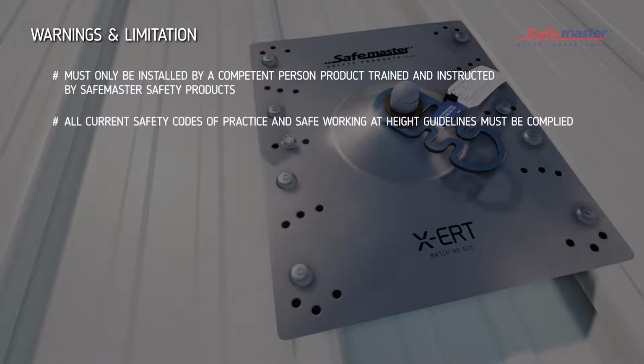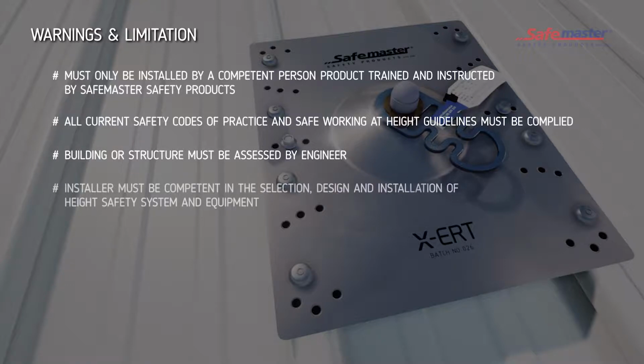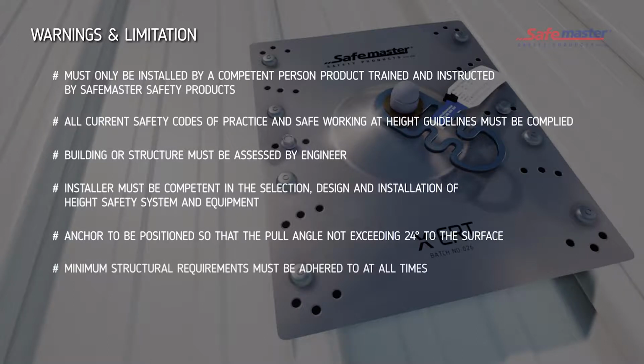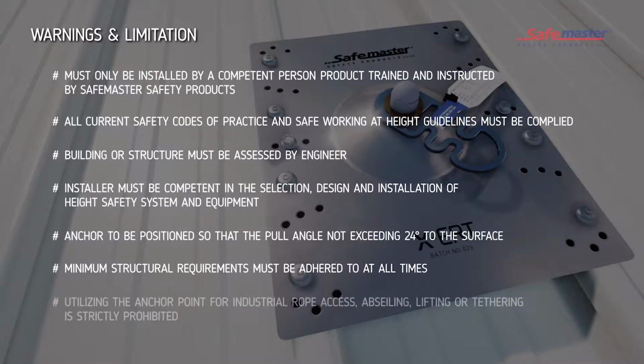The building or structure to which the anchor is to be attached must be assessed by an engineer, unless it is clear to a competent height safety system installer that the structure for connection is suitable and adequate. Persons installing the APS205 ERT surface mount anchor point must be competent in the selection, design, and installation of height safety systems and equipment. The surface mount anchor point shall be placed so that the shear load is twice the tension load. This translates to a pull at an angle not exceeding 24 degrees to the surface in which the anchor point is installed. Minimum structural requirements must be adhered to at all times. Please refer to the installation booklet for detail. Utilizing the anchor point for industrial rope access, abseiling, lifting, or tethering is strictly prohibited.